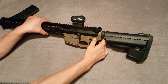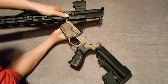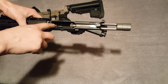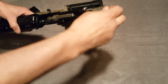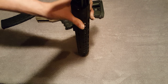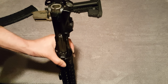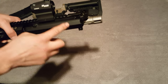I got it back to the house and went through a troubleshooting process. I looked at possibly the spring buffer weight. I thought maybe the gas tube was hitting on the bolt, but I found out online that if your bolt falls with its own weight it's not binding on the gas tube. You just hold it up, release the bolt, and if it closes all the way on its own weight, it's seating just fine and not rubbing on the gas tube.